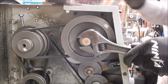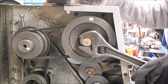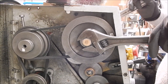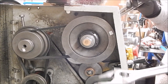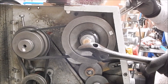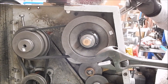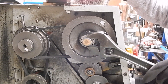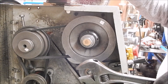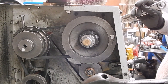Now when you tighten up draw bars like this to hold the collet chuck in, you don't go berserk and tighten the bejesus out of them. I see people do this quite often - they tighten the things up like car wheel nuts. You don't. All you do is just nip it up tight so it comes to a bind and then just go about a fifth of a turn, if you're lucky. That's all you have to do. Just think of it like this: how much pressure is on the tailstock when you put a dead or a live centre in there? Very little. So sure as hell, you don't need to pull the bejesus out of this to tighten it up. Otherwise when you go to release it, you're going to unscrew it and beat the hell out of it to loosen the taper again, and that's doing no good at all for your headstock spindle bearings. That's why you never ever over-tighten draw bars.